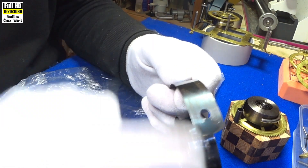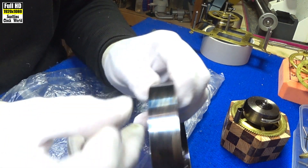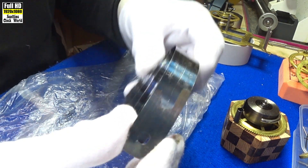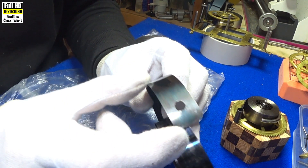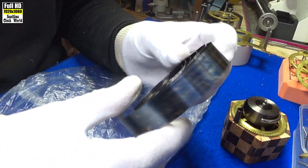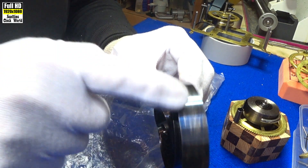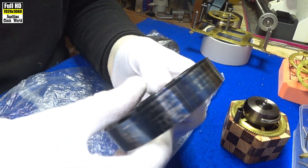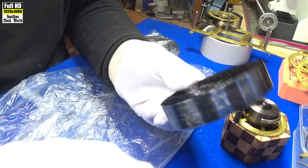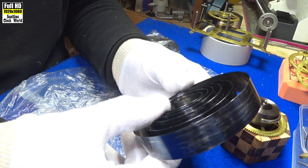What many people do is just cut a chunk off it, anneal it to make it soft, put another hole in it, then quench it again to bring back the temper, and put it back into the clock. You might only be three or four inches short, but if you do that a couple of times, your eight-day clock is running for seven days and then stops — and you don't know why. It's because the spring has been nibbled away over time by so-called repairers who, instead of putting a new spring in, just cut a bit off. It's cheaper but incorrect.